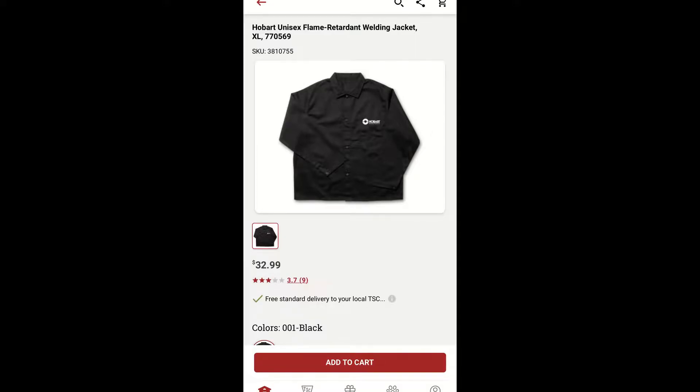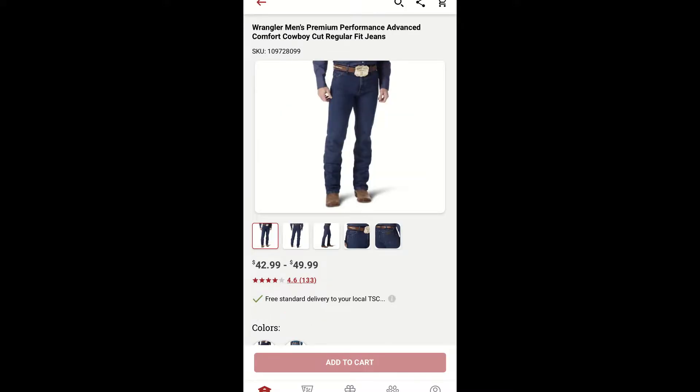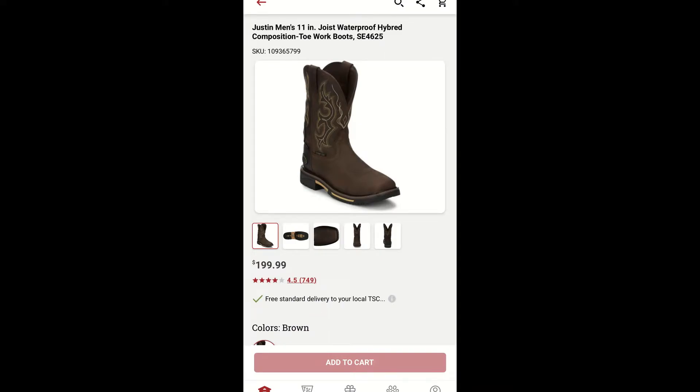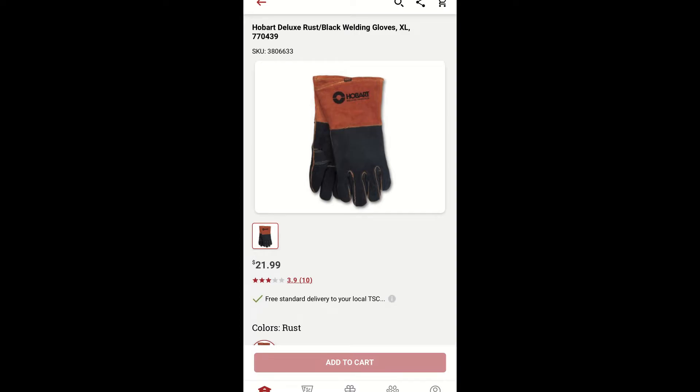Now I'm going to take a minute to talk about proper personal protection gear. First, you're going to need a good welding jacket — very useful because you don't want sparks, slag, and spatter all over you as it can burn you pretty bad. Next, you need a good pair of flame-resistant jeans for the same reasons. You'll also need a good welding helmet to protect your eyes and face from slag and spatter. You need steel-toe or composite-toe boots because in a shop you'll have lots of heavy metal that could drop on your toe. And you need a good pair of welding gloves because you do not want to burn your hands. I will put links to all my gear and equipment in the description below.